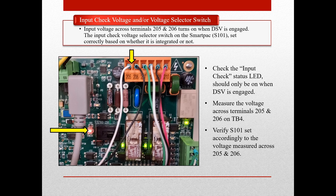Start with the meter set to AC volts to see if it has 110 volts AC or higher first. If the voltage reading is extremely low, then you will likely have to set the meter to DC volts and measure to see if it has 24 volts DC across the terminals. If the voltage is correct, ensure that the S101 voltage selector switch is set according to the voltage measured.